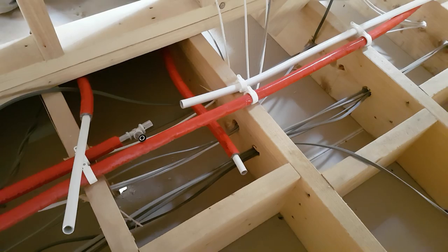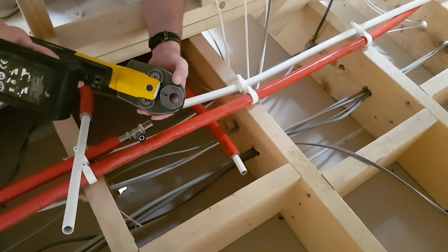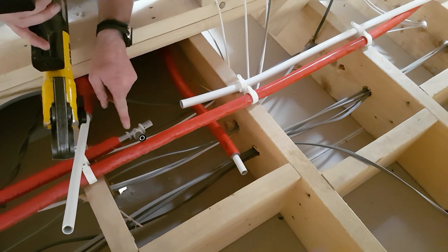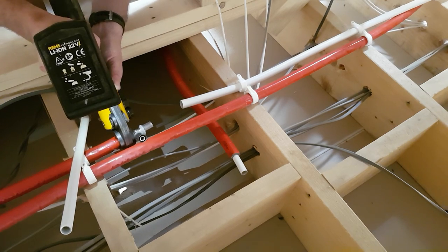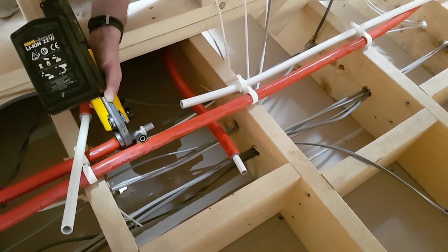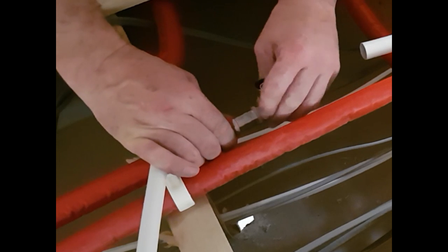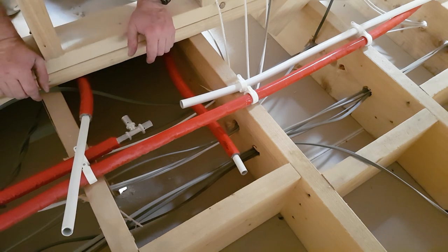This is my gun, a REMS tool. You can hire these I suppose. And this is the 16 mil head for it. It rotates — you can rotate it to get the handle out of the way in awkward spots. This plastic shoulder sits into a rebate on the inside of the die, and I just pull the trigger. And when it springs release, you hear it — and that's it. It's got two ridges on it and it's being squashed onto the pipe. It still rotates because it's on O-rings, so this is a tight seal, a bit like a hose-lock fitting.